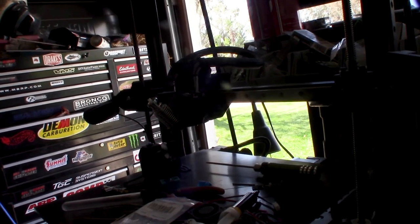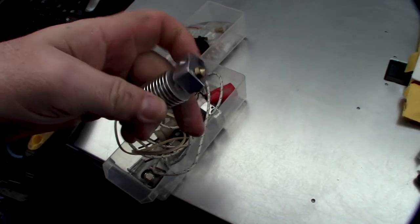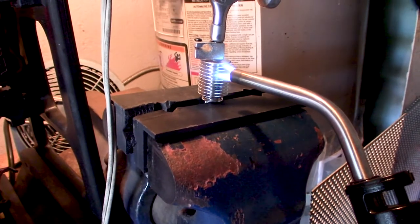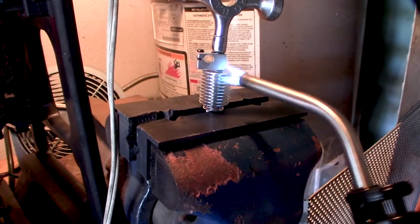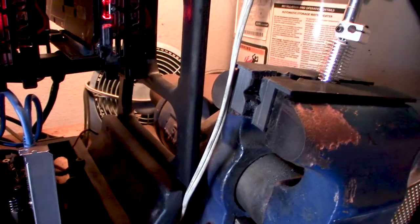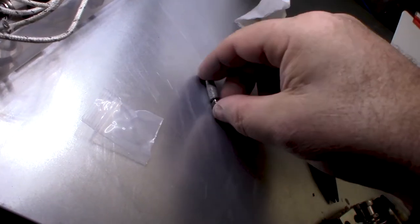I hooked up one of my extra heater blocks just to get this thing out. The jam is so bad I'm going to hit it with my torch real fast just to separate it. It's jammed in here somewhere — definitely some heat creep issues even though I'm using thermal paste, which is kind of weird. I finally got it off. Here's a look at the heat break side by side — that's the original one.